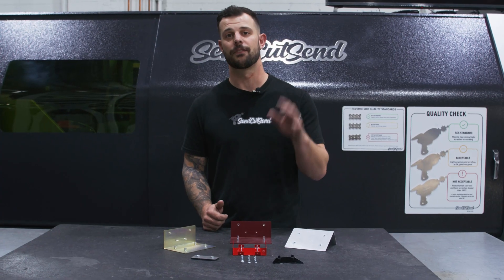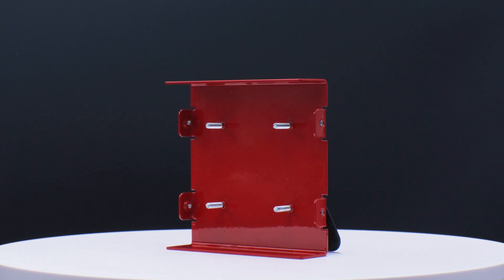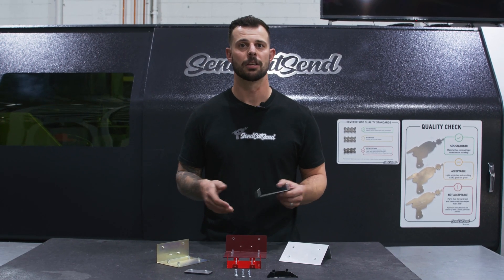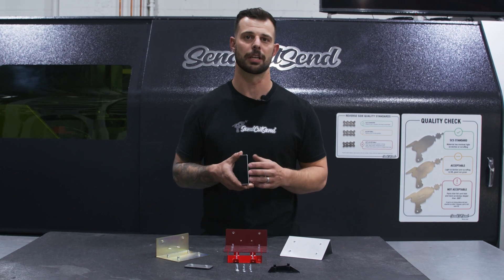The hardware is installed before the powder coating process. We do offer thread protection, but powder coating can be noticed on the outside of studs and nuts. Hardware is installed after bending, so complicated parts with deep pockets may not be eligible for our hardware installation process.